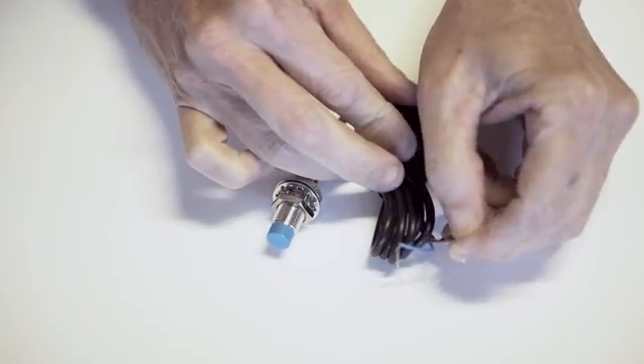I want to try some iron dust. This is a bunch of different materials from my lathe tray, but there's a lot of iron dust in here. After sparsing it out a little bit, it does pick it up. So that is a consideration — you may need to watch out to make sure that chips and material being machined don't interfere with the proximity switch.